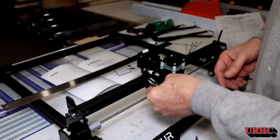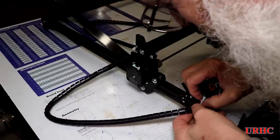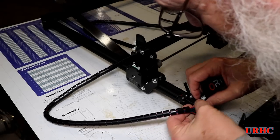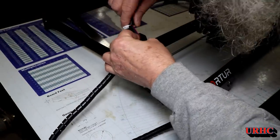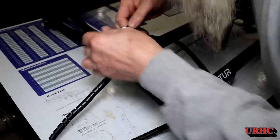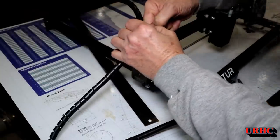One thing I can't stress enough: make sure you get a good pair of glasses when you use these lasers because they can blind you. These are very dangerous, high-category lasers. You don't want kids or pets in the room because it can hurt their eyes too. You have to use a lot of care — these things come with no real eye protection or safety features. The cables all plug right in one way only, and then you put tie wraps at the points shown in the assembly guide for strain relief so they don't get broken during all the moving.